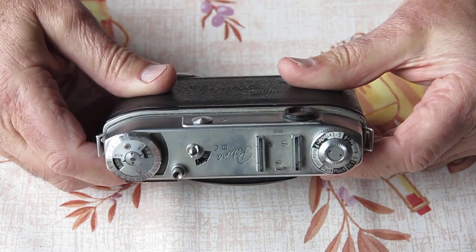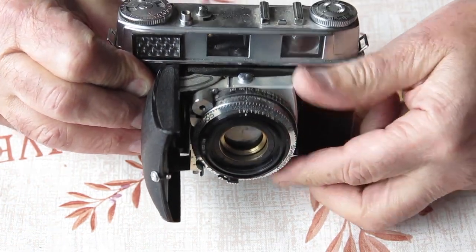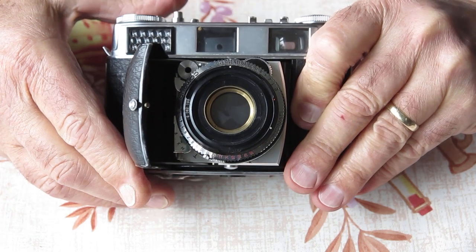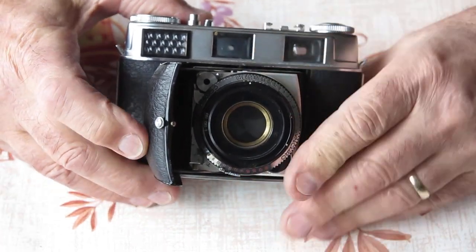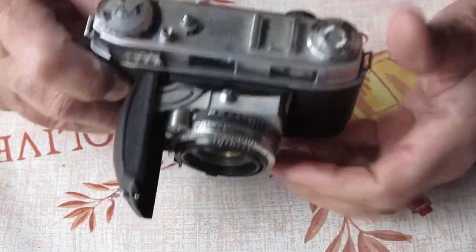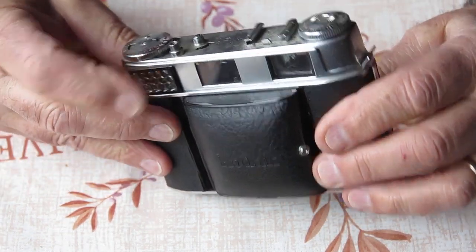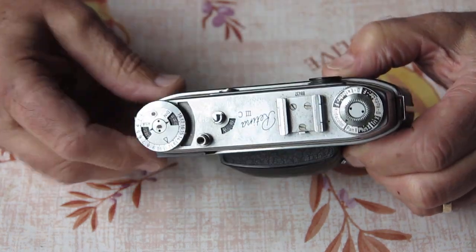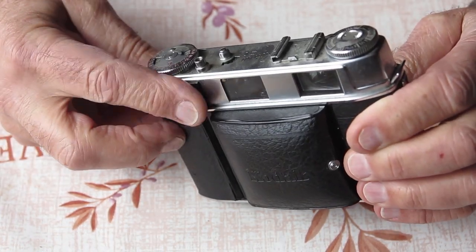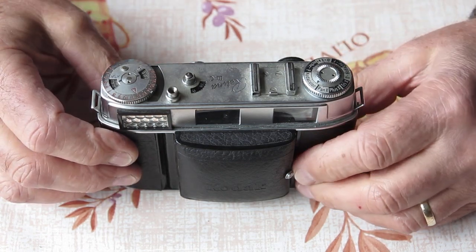Anything else to note? Viewfinder is a bit hazy. The camera opens and shuts. Focus moves smoothly. The film advance is a bit stiff, a bit reluctant to go back to the park position, but the shutter fires. So the cocking rack is probably not too bad. This is very, very dusty — it's obviously been sitting somewhere, probably on display on an open shelf for some time. The exposure meter: I can't really see much through the top there. That window is so filthied up it's hard to see through it, and I can't see any sign of response to light here — suggesting the selenium cell is completely exhausted, or the movement is buggered.